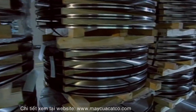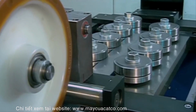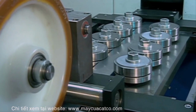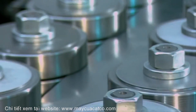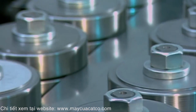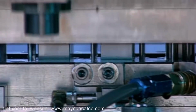Top products can only be as good as the materials from which they are made. In the Swiss town of Wil, the manufacturing site for STIHL saw chains, steel strips and wire are produced on enormous coils. Thanks to high-quality alloy components and such additives as chrome and manganese, the alloy is extremely hard, tough, and heat-resistant, ideal for cutting tools in general and steel saw chains in particular.